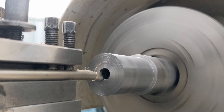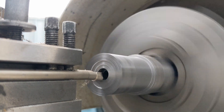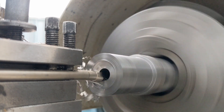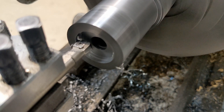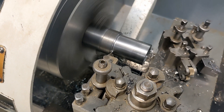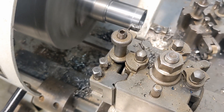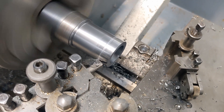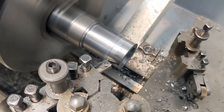The second part was the bracket itself, so I repeated the process — removed some material from the base and made a housing for a second set of thrust bearings. While doing all the cuts, I tried not to remove the bar from the chuck or move it around, because I wanted all the parts to be concentric.